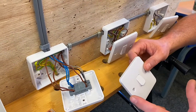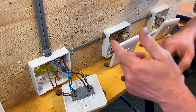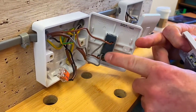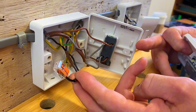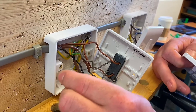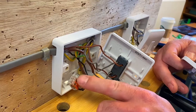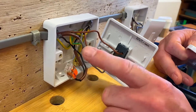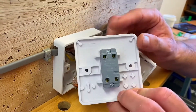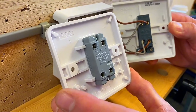The keen-eyed amongst you would also say: hang on, there's an extra connection also in the intermediate switch. As we pull it round, we've only got the brown and grey cables being passed through the intermediate switch. For my system, I always use black - the one that's going to be connected together - it just passes through here to get to the next two-way switch. So if I had an intermediate switch from the Schneider range, hopefully I could get rid of this connector by making those connections in the back of the switch. So I bought an intermediate switch - and as I turn it over, only the four connections that I require for my intermediate switch are there.